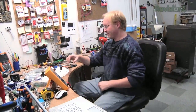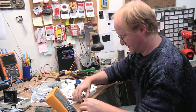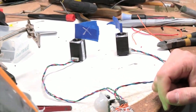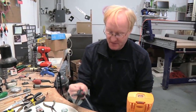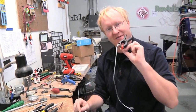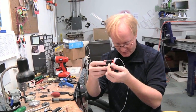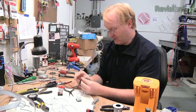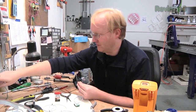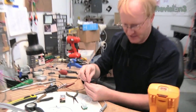I'm programming the EEPROM so the program will stay resident and we won't lose it when power goes off. I plug in the X motor and the Y motor, give it power, and it appears to be working. Next thing is to make it respond to the motion sensor and make a mount for these things to drive the laser pointer. I took apart the laser pointer, glued the button on, and wired the batteries separately so it can be powered remotely by the microcontroller. There were three batteries at 1.5 volts each — 4.5 volts total — and 5 volts should be close enough. We can now control the laser turning on and off.